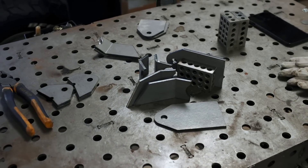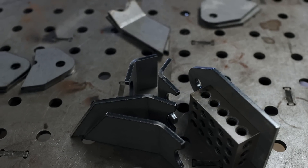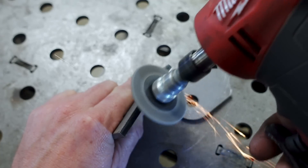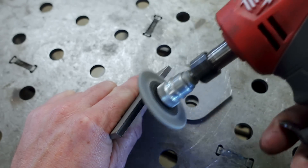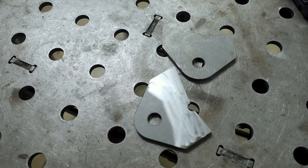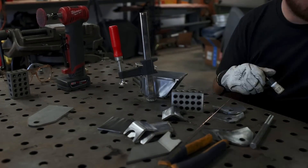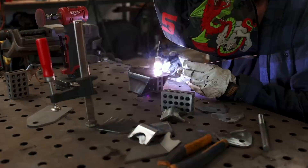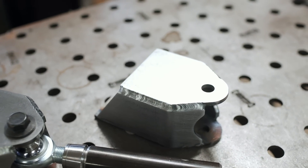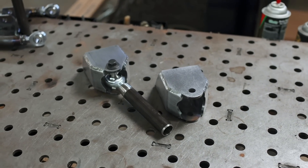With a ton of welding ahead, I decided to start with something easy — the tow link mounts. Because this stuff is made with 3/16ths hot-rolled steel, we need to clean all of the mill scale and kerfing off of the edges. I'm using the 3M deburring wheel, and it's doing the job without a hitch. Everything is primed and ready for TIG welding, so it's time to clamp everything into place, square it all up, and get it burned in. Lately I've been sticking with 3/32nds lanthanated tungsten paired with 1/16th filler rod, and while I get great penetration, I also get really nice puddle control.